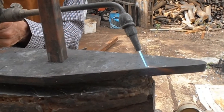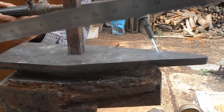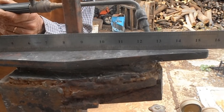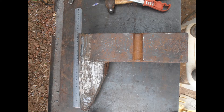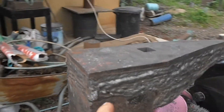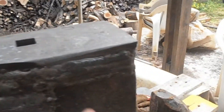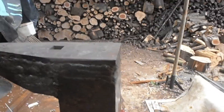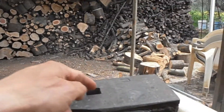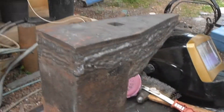I made a big miscalculation that the material would straighten itself. My biggest mistake is that I did not weld the whole plate at the same time — I left this bit of tail and it is always bent downwards. Here is a picture showing the dimensions so far in centimeters — full welding all around. So far I've invested something like 15 to 16 hours of work to cut the plate, make the hole, and weld everything, using electrodes 7018 at 3.25 millimeters and 4 millimeters.